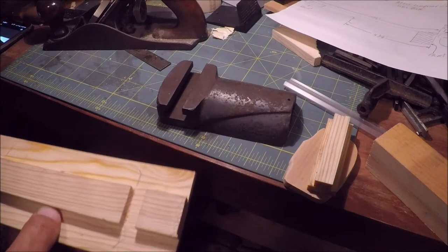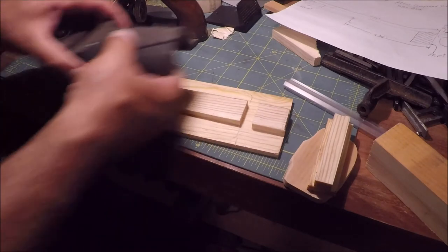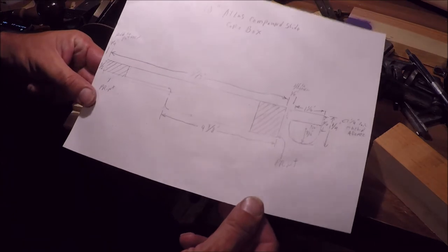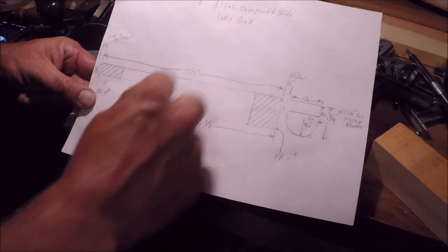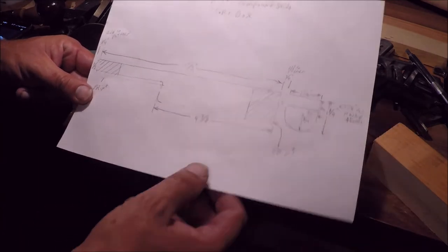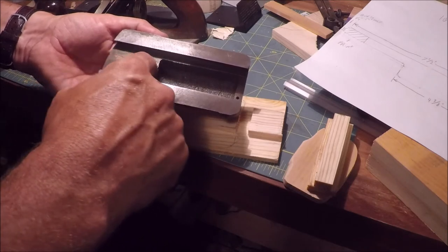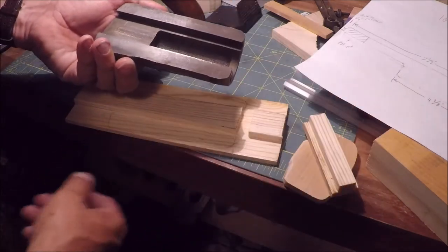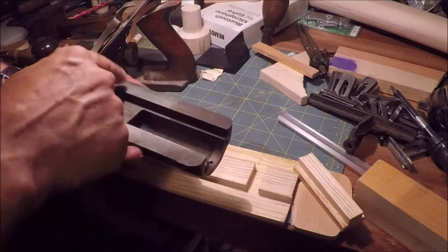I figured I'd go about doing this a little bit differently than I did for the 618. My plan is to build a core box. The core is going to have a little thin section and then a larger, almost oval, half-cylinder kind of shape. It will produce a good section of this part, and also a big core where the screw rides inside - just a cavity for that screw, nothing requiring real high precision.